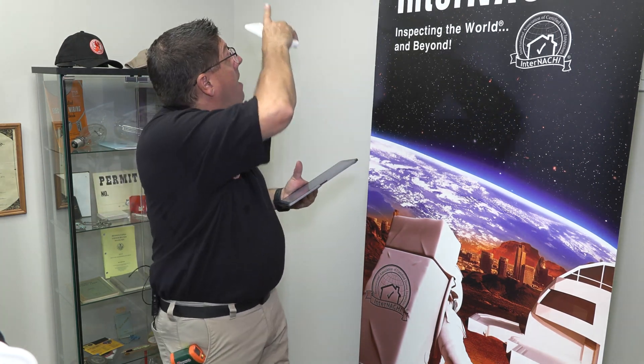One of the advantages of a mini-split or mini-split heat pump system is the fact that they're ductless, so these can be installed throughout a building wherever you can snake the line set for the evaporative or heating unit. That unit is located up here in this box. If I have a server room that needs extra cooling, I would put one of these units in and snake the line set down from the roof. If I have an office that needs more heat or more cool, as long as I can snake the line set as well as the condensate pipe, I have the ability to add these units anywhere I want.